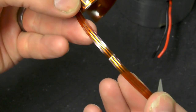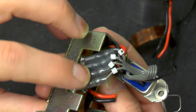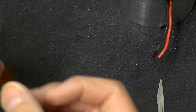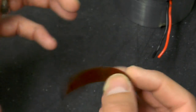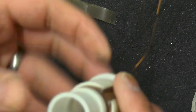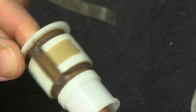There are actually four connections here — two wires on the top and two on the bottom — so we've got two separate circuits on this. Biasing between one set of four coils and the other set of four should be able to squash and squeeze the beam to make it nice and round and very coherent. There's another coil with only two wires — one field one way and one winding the other — and I'm not sure what that one is for. If anybody knows what that particular coil is for, please leave a comment.